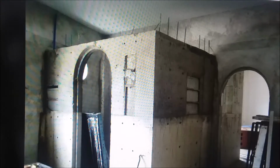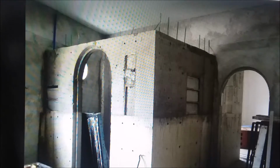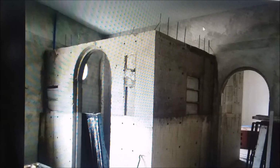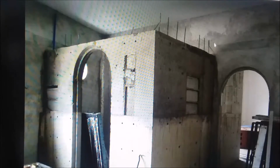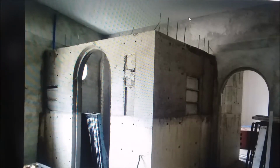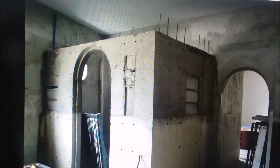This is just a little view farther back. And you see the rebar sticking out of the top. That's because there's another short lift goes up here. It'll leave 16 inches to the ceiling. And this beam is 24 inches. So it'll be up around here someplace. And that's where we can put 1 row of glass block or 2 rows of glass block at the top. We want to leave an air gap above the top block to draw air in because there's a ventilation fan in this wall. And we want, with the door closed, to make sure that the air comes from the ceiling and gets rid of condensation. That's bathroom 1 with the stuff taken out, making room for the blocks.